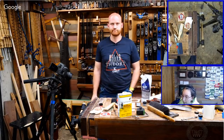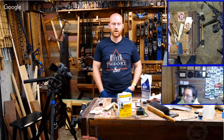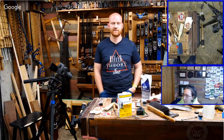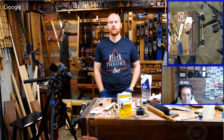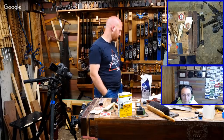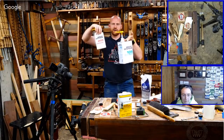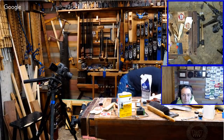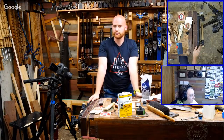Samwise asks, could you use a hammer and file on brass instead of a plane? Yes — a file will cut through it very quickly and pretty easily. Brad's Workbench asks, ever use fiberglass resin as a cheap form of epoxy? Well, fiberglass resin is an epoxy. When I built a four-seat aircraft using West System epoxy, that was the resin I used to cure the fiberglass in.